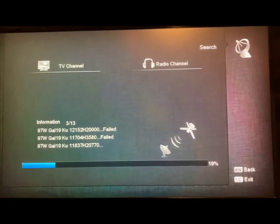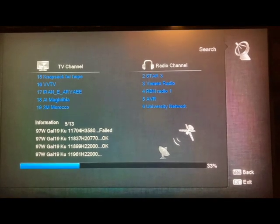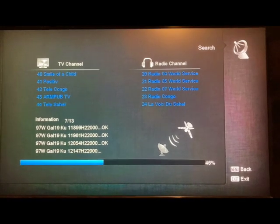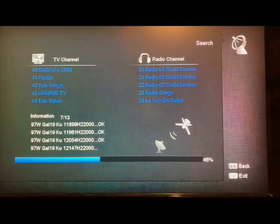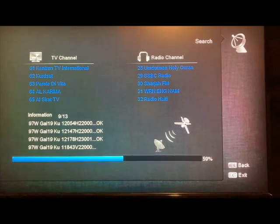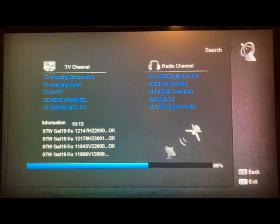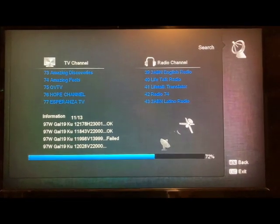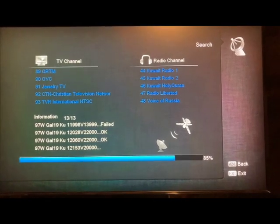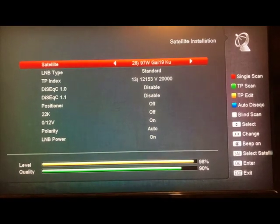When I first got this, I was using a smartphone app and also a website called dishpointer.com to aim the dish. For the receiver, I'm using the Amigo Mini HD, which came from eBay as well. It has the satellites and transponders preloaded. Overall, it's pretty simple to aim, do a scan for channels, and once that's done, you're good to go. Originally it was much more difficult — when I first got the dish I didn't really know much about it. But now that I understand how everything lines up, I know where to point the dish and can get it going pretty quickly.